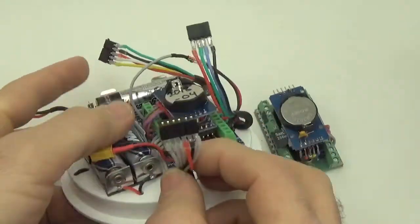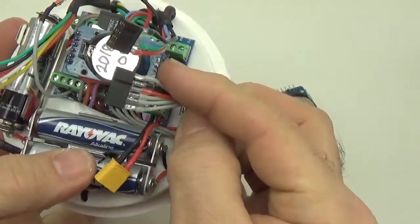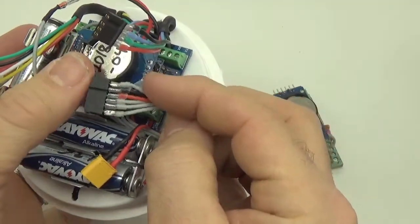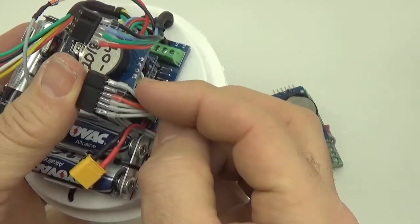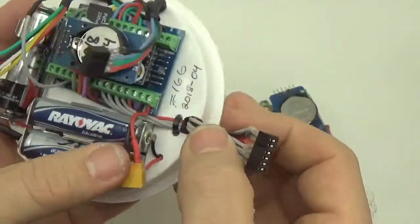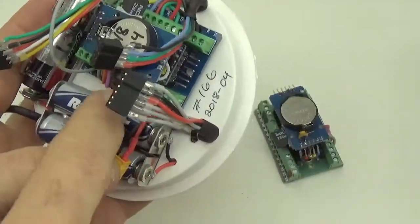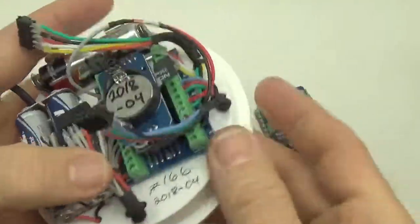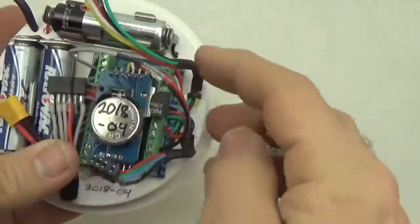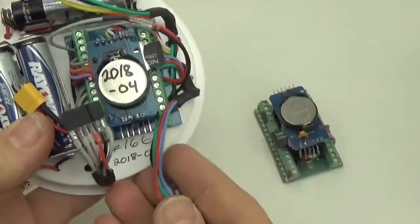And these are all of the analog lines on the Arduino broken out. And I've started using this type of connector for driving SPI displays using shift out. So this is a 6-pin connector, which is about the biggest one that I use. This is actually a little hard to solder. So unless you are connecting to a display like I am, or if you want access to your analog lines, if you don't need it, you wouldn't bother adding this wire. This is all optional. So you basically have to decide what it is you're connecting to your logger, and then before you glue it down, it's a lot easier to put the wires in, especially the wires on this side, before you adhere it to the plate.